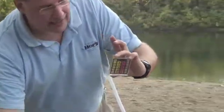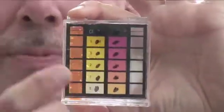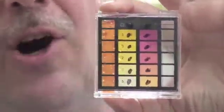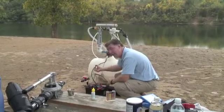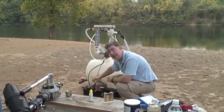In fact, our tank is now so chlorinated that we can shut off the process. It has turned to an orange color, which is past the normal 5 parts per million. It's gone to about 7 to 10 parts per million already. So we need to stop the process, is what you're saying. We do, yes. I'll do that right now. And the way we do that is very simple. We just take off the electrical leads so that we're no longer doing the electrolysis process.